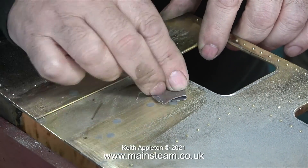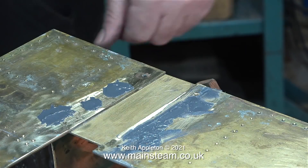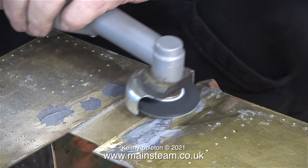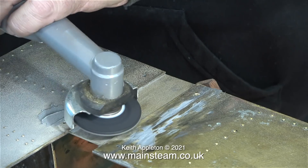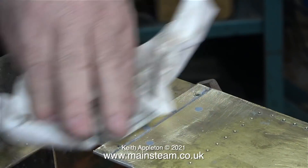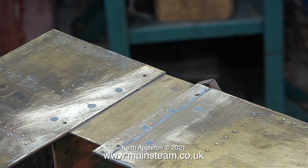When building miniature steam locomotives the choice of metals is a bit of a minefield. Most paint is reluctant to stick to brass, and even the etching primer I use is not designed for brass - it's designed for ferrous metals. You're between a rock and a hard place. If you use steel that's okay, but if the paint chips, water can get under and start to creep and before you know it you have a really weird looking engine. What about stainless steel? Well it's the same again - paint doesn't like stainless steel and doesn't stick to it very well. So I'm going to live with the brass parts of this engine. The boiler of course is made from copper. You need to give the paint a chance to harden thoroughly before using the engine, and then the heat from the boiler will usually bake the paint on over a period.